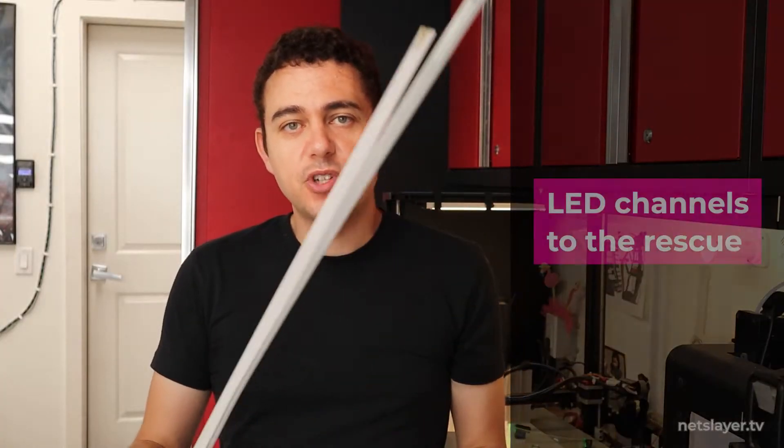So for the new art car, we found these aluminum channels. They come with milky plastic covers that just snap inside, and they hold the LEDs in place while also providing some diffusion. They're often used underneath bookshelves and on walls around homes to provide a glowing effect. What I like about using these is the diffusion is strong enough so when you look at it, it actually doesn't hurt your eyes. You can still make out the pixel, so it supports playback of high-resolution sequences.